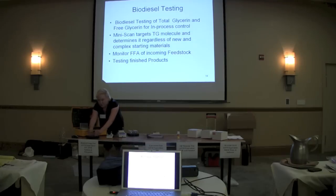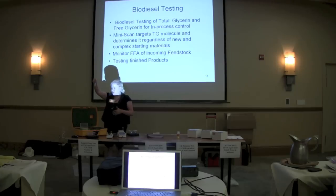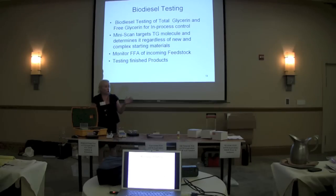I think you can see the difference — that original sample was pale yellow, and when it reacts with the biodiesel, it picks up a reddish pink color. That's the indicator of total glycerin. The range of this test is from 0 to 0.6. Our target is to be below 0.24, and many plants want to be below 0.2. It's going to give you a quantitative answer to three decimal places in terms of the amount of total glycerin in your biodiesel. The correlation with GC is 0.99.